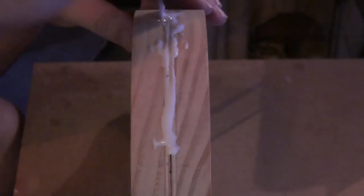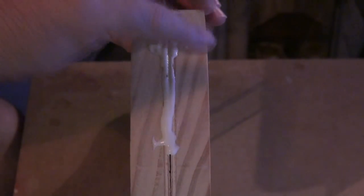This split in the body is exactly why I inserted screws into the body. At least this repair gave me an opportunity to demonstrate how I did sink the other screws into the core of the body. This edge split apart about 48 hours after I had trimmed the edges. I guess the wood was resettling after being glued, screwed, clamped, and cut. Looking back, it was most likely the removal of surface area containing glue.